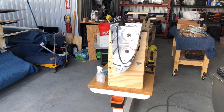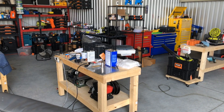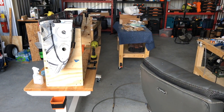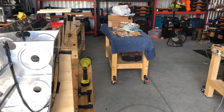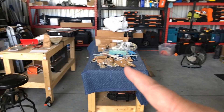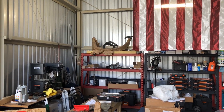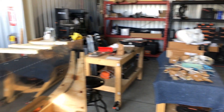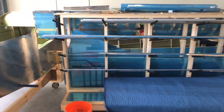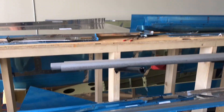Fuel tank number two is in the rack and it is being pro-sealed. I'll share a little bit of that — there's my pro seal mixing table. It's just a lot when you get parts from Van's; there's a lot of inventory. I've been spending a few days getting the inventory done, finding new homes for parts like the windows. The long cart I built has been phenomenal — there are a lot of long pieces that come with the fuselage that need storage.